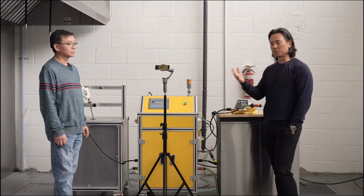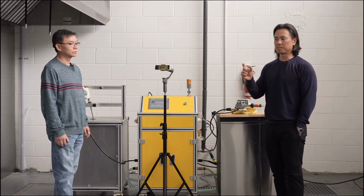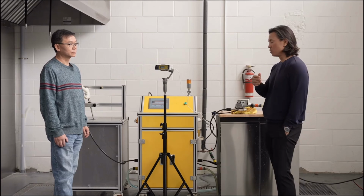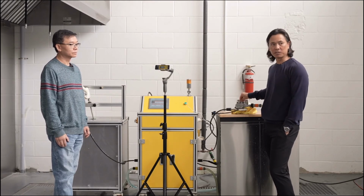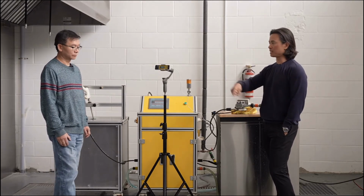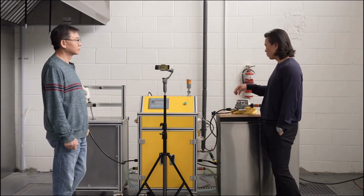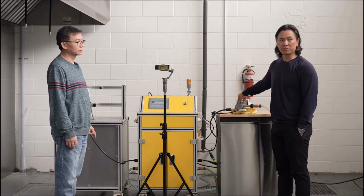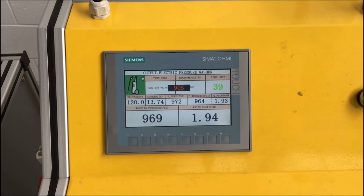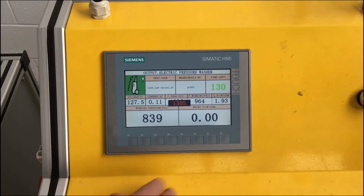The old design, you could say, the auto cutoff valve was sticking and therefore was not cutting off the unit, or when used sometimes with the 50-foot hose, there wasn't sufficient pressure building up. Therefore, the unit would surge and keep cycling because the auto cutoff valve wasn't working the way it should. So the objective, of course, is we want to make sure the pressure within the pump stays at a reasonable level. In this case, it's under 2000 PSI. The peak pressure is at 1996, which is below our 2000 PSI objective.